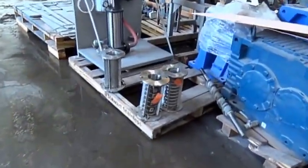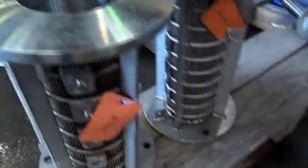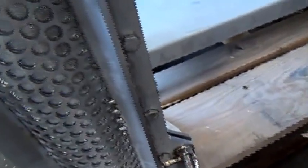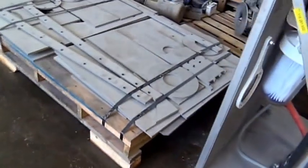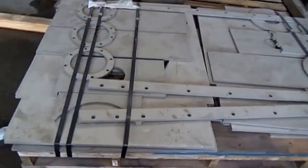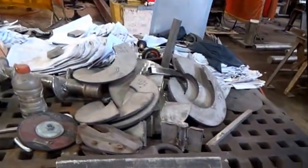There's a wedge-wire screen for the same four-inch press we were using. Here you can see the narrow slots on the inside. This screen, in contrast, has perforated metal on it — fine holes there and reinforcing three-eighths on the outside. So those are your screen options. Here's raw material — we used to plasma cut our own parts, but now the steel suppliers all have water jet cutting. These would be parts we've ordered for some production run. We buy flights and make screws.